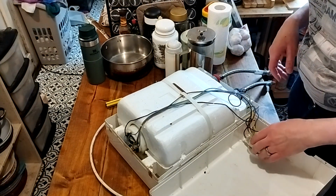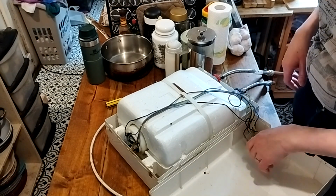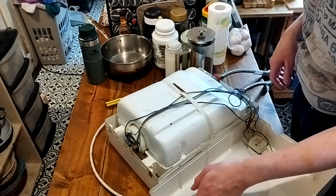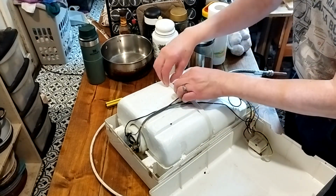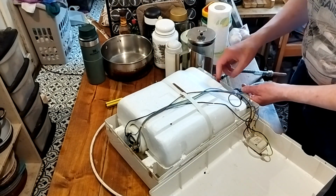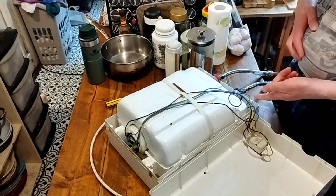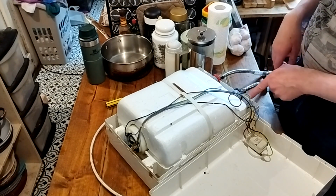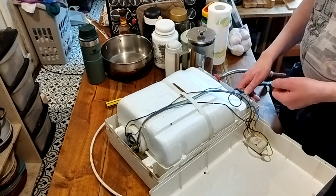Okay, so what got wet? Let's have a look. Well, you can tell that it's mostly okay. Now, the device itself appears to have some debris in the bottom, which is to be expected considering how it failed. There's no obvious break in the top here, no moisture lingering around, because you can guarantee if it had been leaking at the top, we'd have seen corrosion on the main contacts here, which are exposed, the initial manufacturer's design exposed and next to a thing liable to leaks.